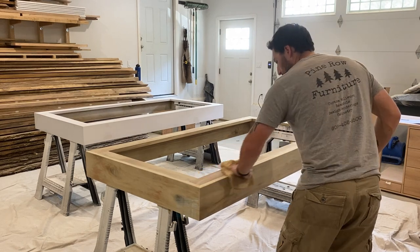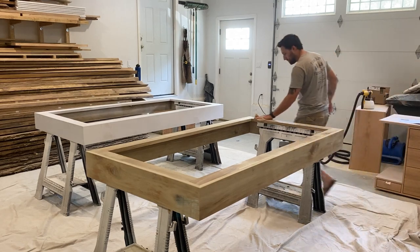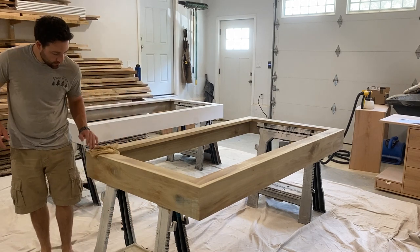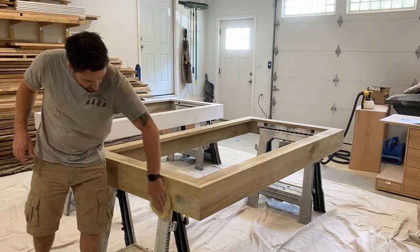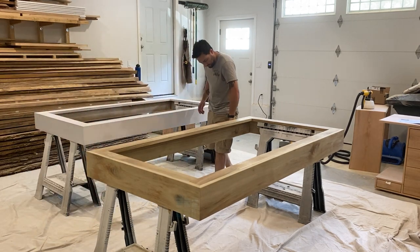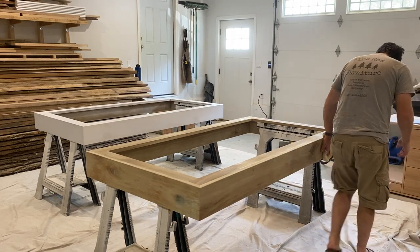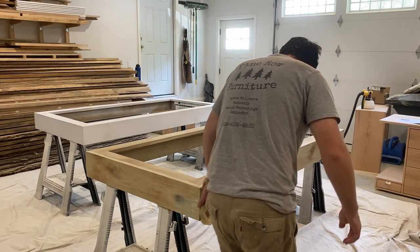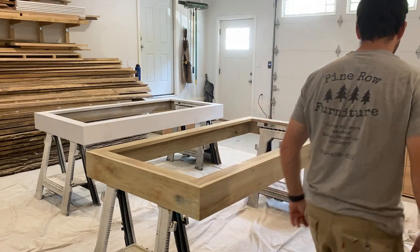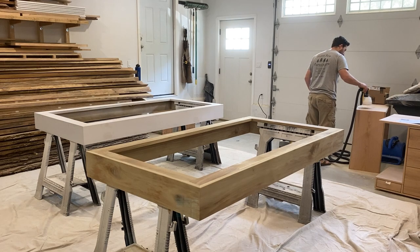First, you want to make sure that the air is not dusty. The day that I always do paint, I never do any other woodworking in the shop to avoid any airborne dust. And right before I paint, after I have everything set up and staged, is to wipe every surface of it down with a good tack cloth. That gets rid of any bit of microscopic dust and dirt that could be on the surface. Once it's completely wiped down and clean, I'll then get my painter set up and start spraying.